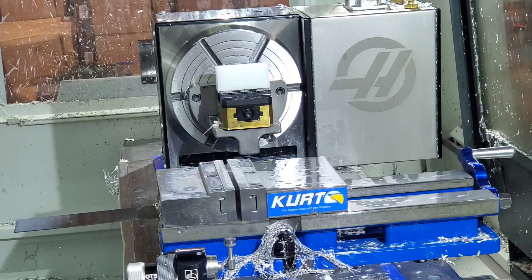I don't know if you can see the little black line at the top and bottom. I only have 50 thou — 25 thou per side — and since I can't actually probe the part, I've got to get it pretty centered on that vise. That's what that's for, to get it centered.